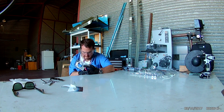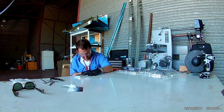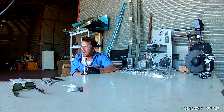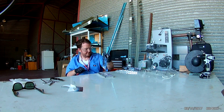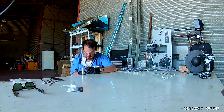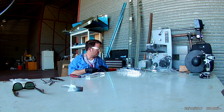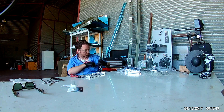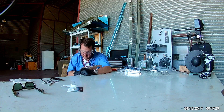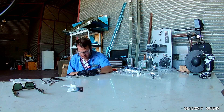The Dremel tool actually works really well. What I bought was small chainsaw blade sharpening stones - they're basically long, skinny stones used primarily for sharpening chainsaws. However, it also works perfectly in between flanges when you want to get a little cleaning done in between the two different flanges and don't want to sit with a file and deburring tool. It's not easy to get in there, but the Dremel tool really makes quick work of it.